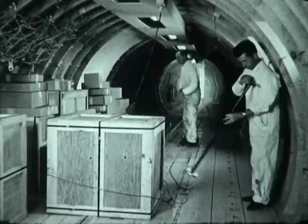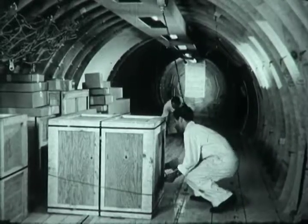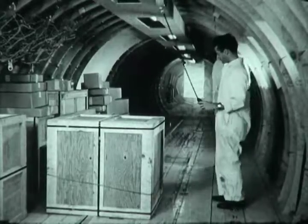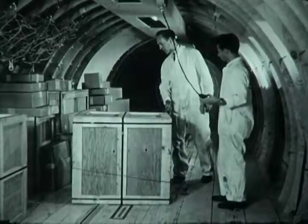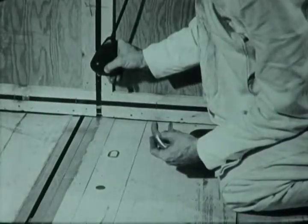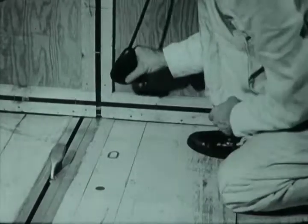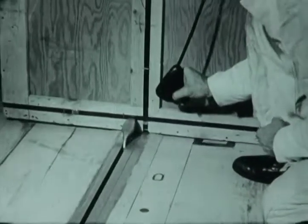Now the cable is disengaged from the pogo stick, giving the conveyor a straightaway pull on the box in order to move it to the rear cargo door opening. Notice that no manual effort is required from any member of the crew, except for steering direction of the box. A donkey may also be used in the conveyor chain for pushing purposes. Here, the donkey is placed in the conveyor behind the box of cargo, a procedure which is more convenient when a one-man unloading operation is desired.